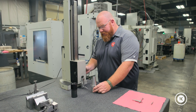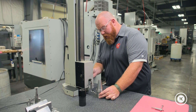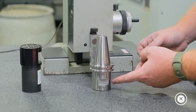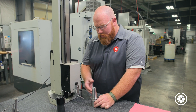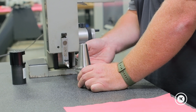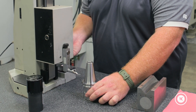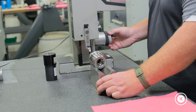Now that we're calibrated, we're going to set our zero on the table using the offset ball probe and use that location to find the width and the location of this slot. This style of probe is nice for being able to set your zero off the table to reference that from one end of your part to different lengths along your part. These types of probes are the most versatile — being able to zero off the table, you can check lengths of your part, and you can switch it up and make it a diameter checking tool as well.